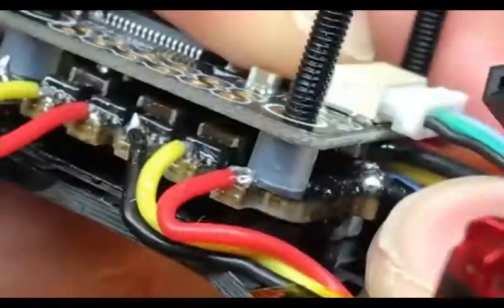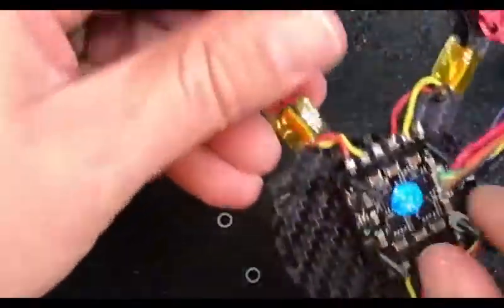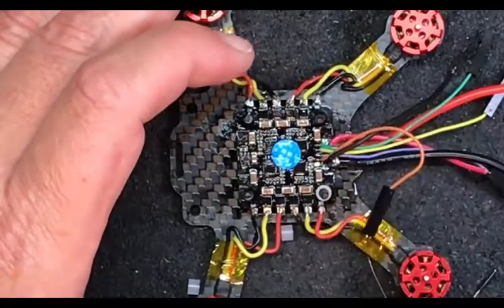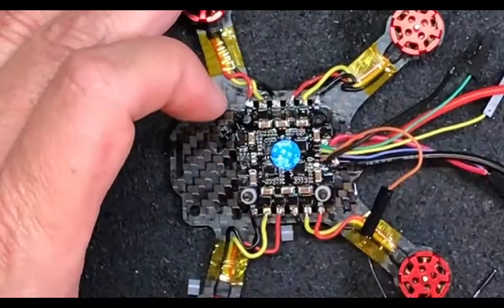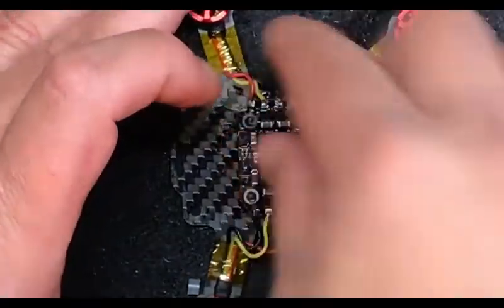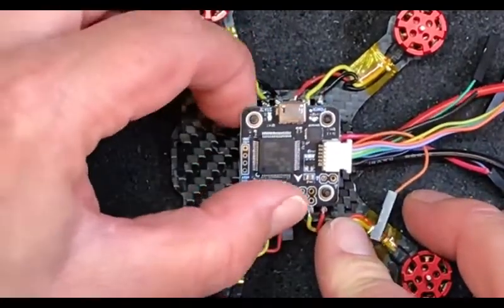What's going to make this nice is he'll be able to get his USB connection in very easily, plus his motor inputs and outputs are going to be lined up for nice quick access. Also go with the larger standoff - we don't want anything touching the carbon fiber. Conformal coating isn't perfect - it's susceptible to vibration, so if you have a lot of vibration, it could wear off and you could short out. You want to be efficient but don't be fucking stupid about it.